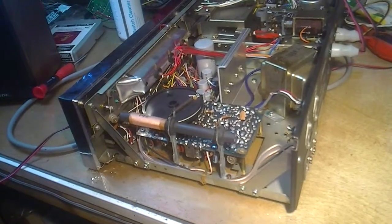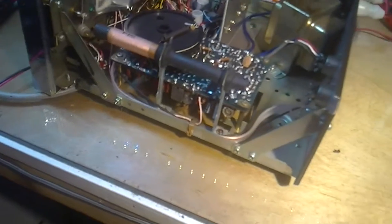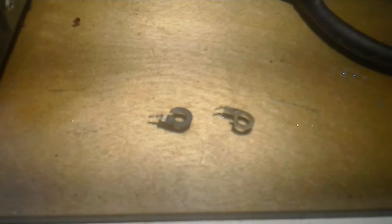So I spent a good deal of time looking at this and eventually came up with something rather startling, shall I say. This trimmer — little potentiometer thing — had actually fallen to bits. It's in two pieces, and where the third part is — the part that you should put a screwdriver into and adjust — who could say, it's just disappeared. So having changed a few of the capacitors and got rid of a rather loud, irritating hum...